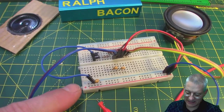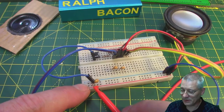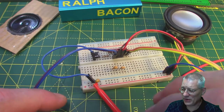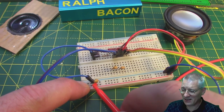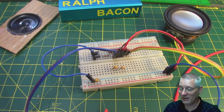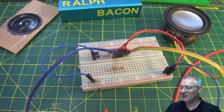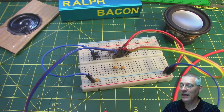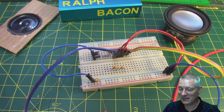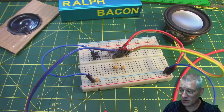I'm just about to connect up the power supply — 5 volts to the plus. Now that sounds very loud to me and it's really annoying. It's 2.6 kilohertz, which funnily enough is what the ear can really hear nicely — about the same pitch as screaming kids actually. You don't need a lot of power to make 2.6 kilohertz heard, but that was just a demo that it's all working. It's coming out of the speaker fine and it was annoyingly loud.